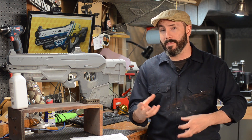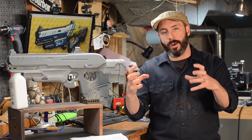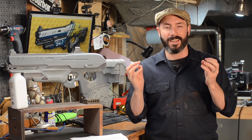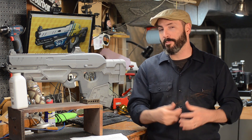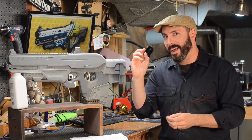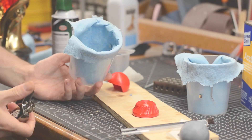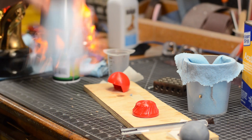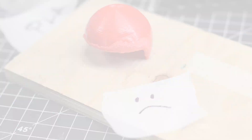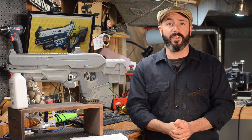Now I know what you're going to say. Someone will point out: hey Bill, you have to do the hot vapor method — you have to warm up the acetone and the vapor to have more of an effect on the printed piece. But I'm not going to do that. I'm sure there is a safe way to do this if you experiment, but acetone vapor is extremely flammable and to heat it up you're going to need some sort of heating element. Those two combinations — flammable vapor and a heating element — are a recipe for disaster. I tried it out myself to show you guys just how flammable it is, and it is frightening. The vapor from your acetone stays flammable for a very long time, and for that reason alone I prefer to stick with just old-fashioned sandpaper.